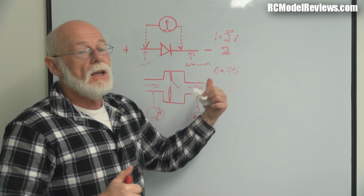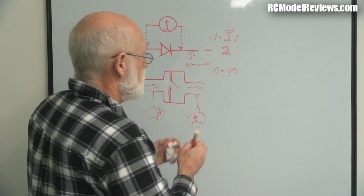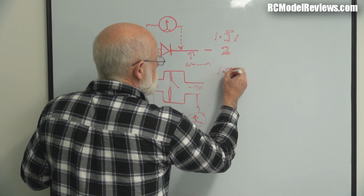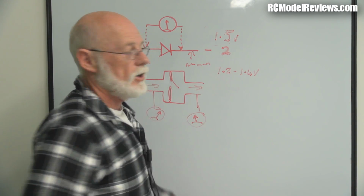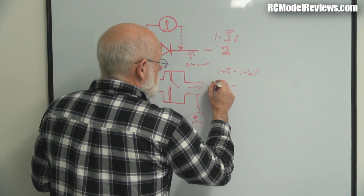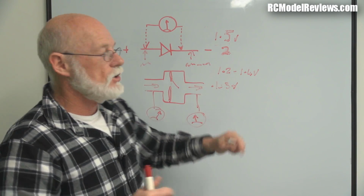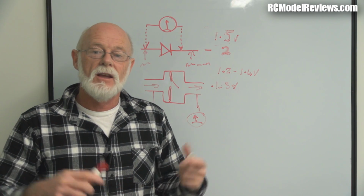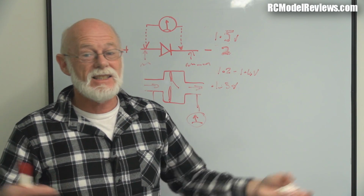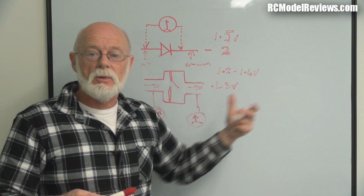In fact, the other thing is there was a FET switch as well. Now FET switches don't generally cause much voltage drop, but you will get a little bit. So what I'm thinking is, the reason our LCD screen reads low is because we've got around 1.2 to 1.4 volts drop across our two diodes, because they're in series, and the rest of the voltage, which is probably 0.1 to 0.3 volts, is across that FET. So there you go. Because they've put all this extra protection circuitry on the front of the power supply going into the LCD, the voltage that it reads is wrong, because all this extra circuitry is sucking up some of that valuable voltage. Probably that's also why on a 2-cell pack it starts having a hissy fit at 7.4 volts, because we've already lost 1.4 or 1.5 volts across all this extra protection circuitry.